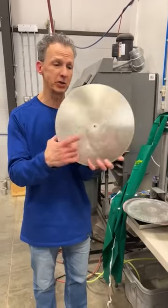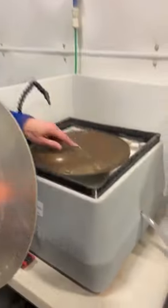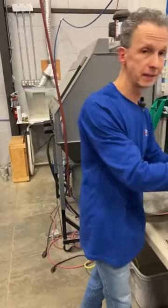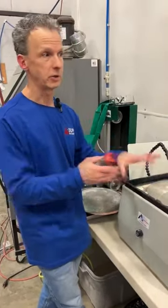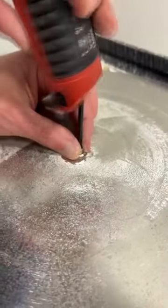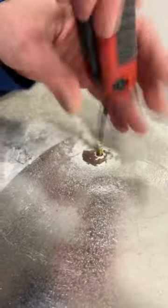The other nice thing about the discs is there's a hole right in the middle. The machine has a little raised brass piece that lets you center the disc instantly — it just slides right on. Some of you might think: what if that brass peg gets in the way when I'm grinding? Well, you can just take it out. The machine comes with an Allen wrench, so you can simply unscrew that center peg. They made it out of brass because it's friendlier — if you bump your glass on it, it likely won't cause much damage.